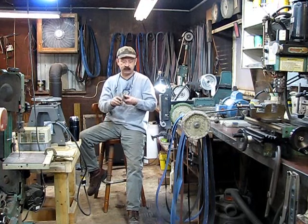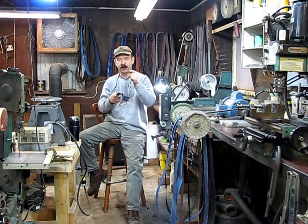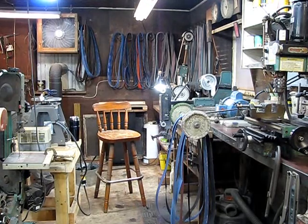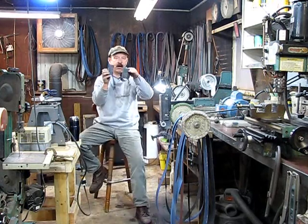I'm going to make a point here about technique, philosophy, and marketing. I'm talking about sanding the flats of the ricasso, the choil, the spine, and both sides — to a complete, flawless 220 hand-sanded finish, all lines going lengthwise. I went over it with my magnifying glasses — not one speck of a line going laterally across the blade. And this is how much sandpaper I used: three strips, one and a quarter inches wide, and two squares. I did it in less time than it takes to drink a cup of coffee.